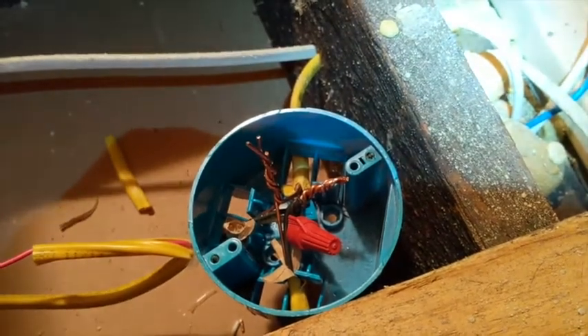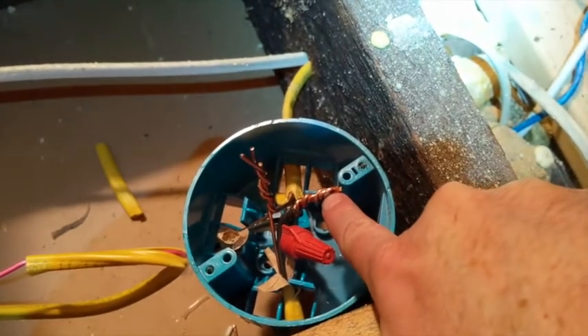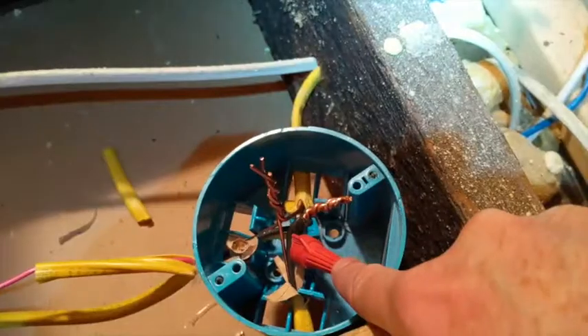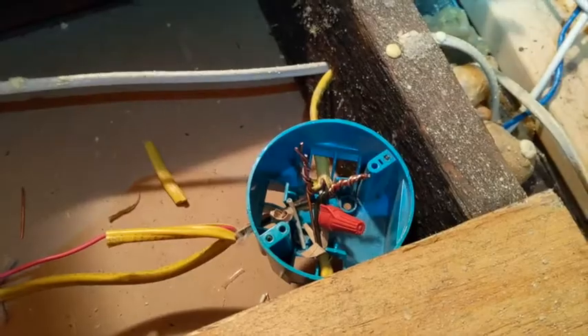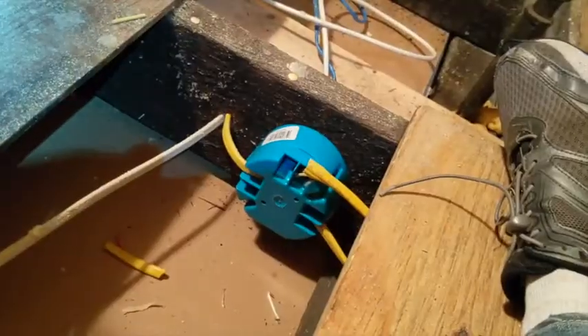Sometimes it takes a little practice to get it right. This is not especially pretty because I'm not a very good electrician, but it works. I'm going to snip the tops of these to make a nice point and then put a red wire cap on it, then screw this box to this joist so there are no exposed wires for somebody to trip over. Code requires that every wire joint like this be in a box and covered, so this should please any code compliance officer.